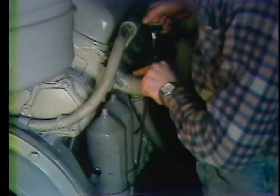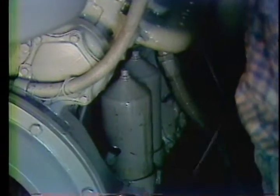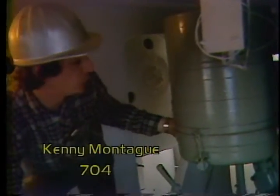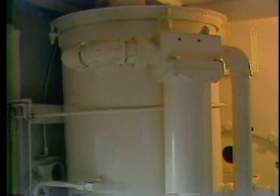Move around to the engine and check the oil level, filling it if necessary. You should be aware of the number of hours on the air filters, fuel filters, and oil filters. Air filters — check for contamination; they should last about 1,500 hours under normal running. Fuel filters — check for contamination; they should run a minimum of 1,000 hours under normal wear. Oil filters should be regularly monitored and changed out as necessary.